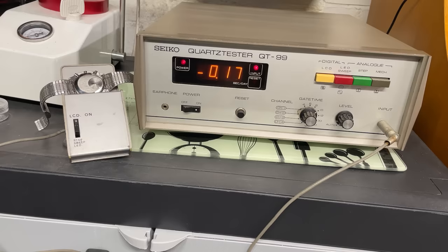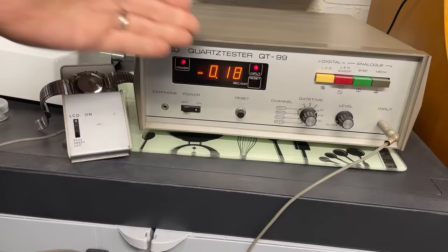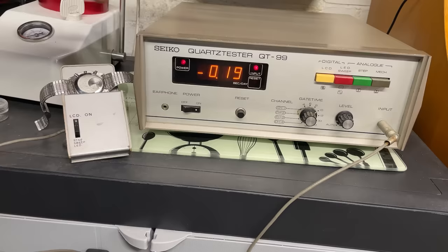So the watch is also affected by temperature. I am in my garage — it is about 11 degrees Celsius, so it is quite cold. As a rule a watch should be warm off your wrist and I do believe you get different readings. Seiko did make the dual quartz movement, which was thermal compensation for that very reason — to keep the accuracy as much as possible depending on the temperature of the watch. We are now settling at around 0.2 seconds a day, so roughly maybe minus seven seconds a month. That's truly, truly remarkable from a watch that is from 1978 — in what was pretty much new technology at the time.